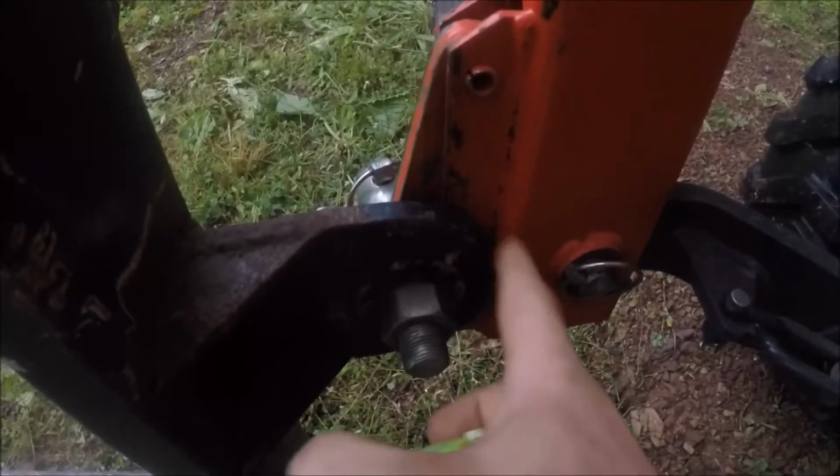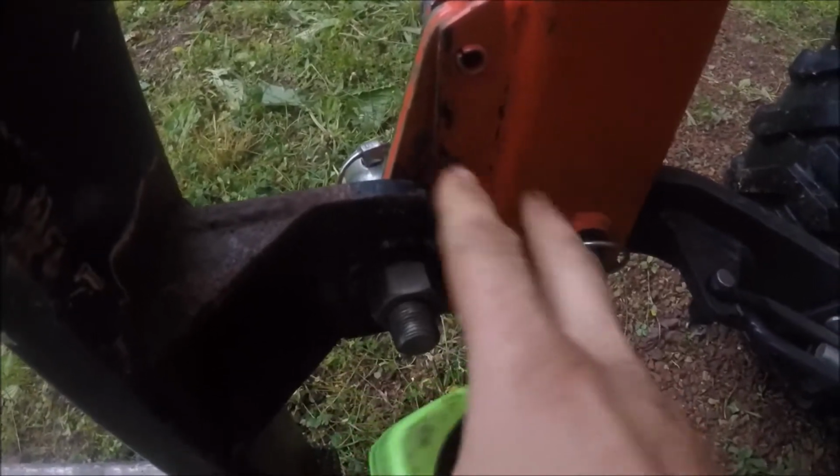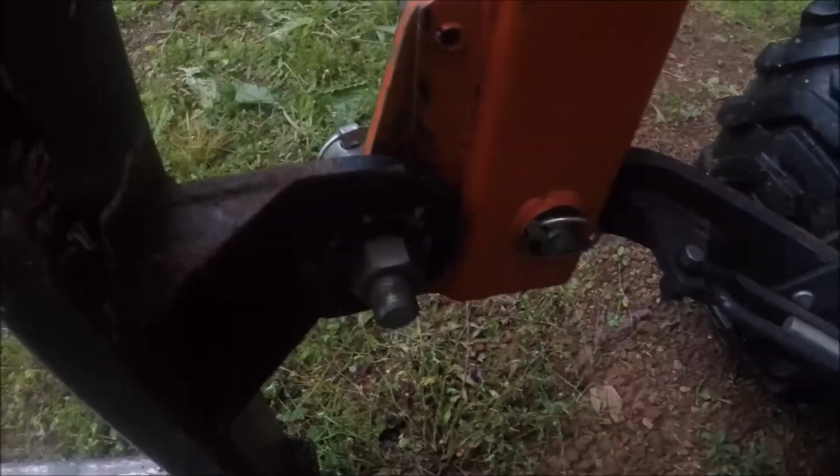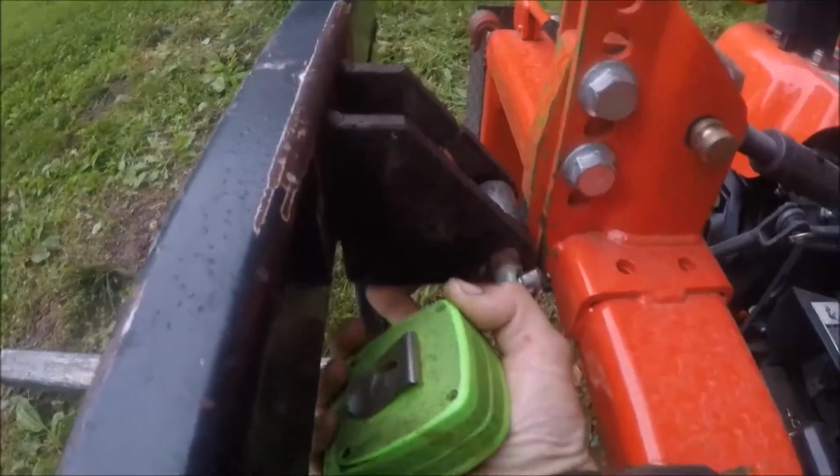Anytime I make something, it's getting dark here, I like to radius the corners, so that way if you're walking by, bump into it with your leg, or even happen to trip and fall, you're not going to cut yourself real bad as you would if you had a sharp edge there. And again, I did the same thing on the top. It's radiused for the top length.